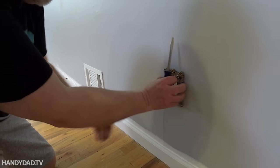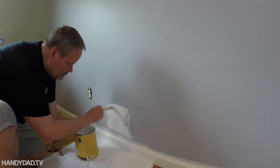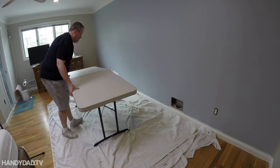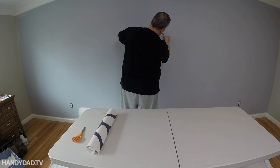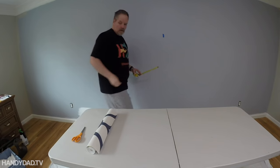You've got to prepare the walls well. I didn't have to paint them again since they've been painted many times, although I did patch a hole and made sure that was painted as well. I put down a couple of drop cloths and a plastic picnic table to use as a work surface. Here I'm measuring the middle of the wall with my wife. The wallpaper is 20.5 inches wide, so I deduct 10.25 inches from the center mark — that tells me where the edge of my first strip will be. I used my laser level to project a plumb line up and down the wall.